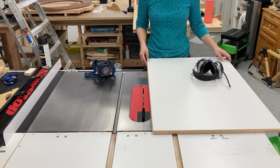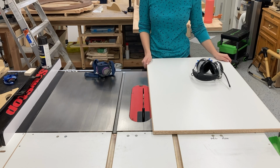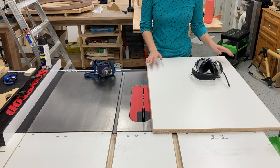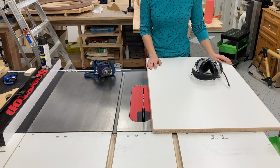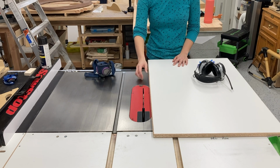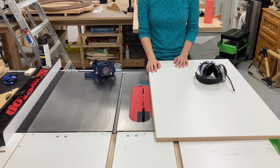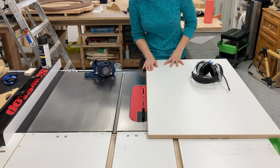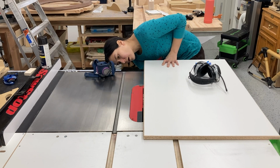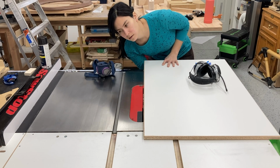Anyway, you've probably seen the platens at school if you've taken Furniture 1 and you've veneered your demilune table, but all it is is a sheet of 3/4 melamine with grooves running through the melamine. And I'm just going to make those grooves or those channels with my 1/8 inch table saw blade. And I'll probably set my table saw blade to about 1/4 inch tall. There's not really a particular height.